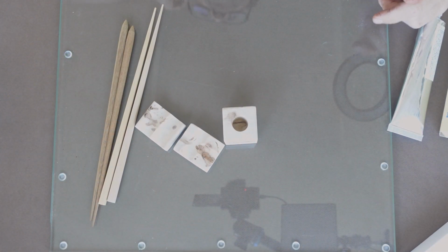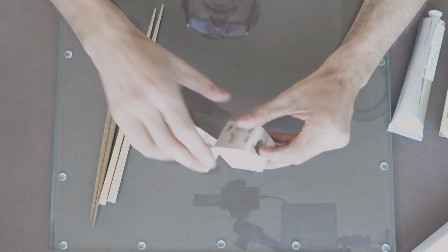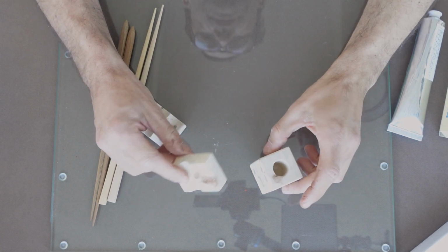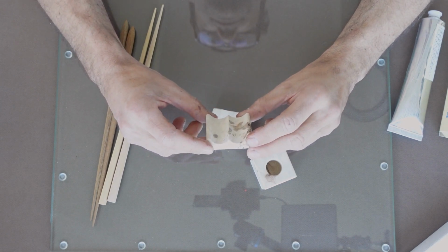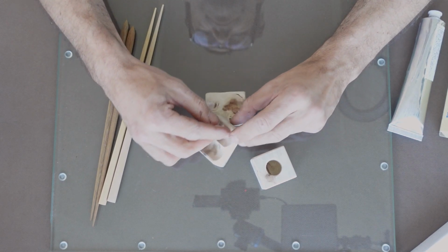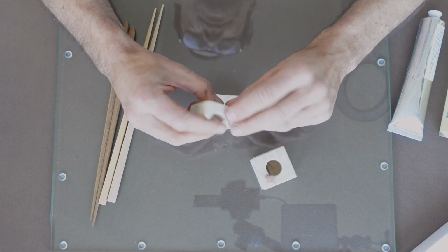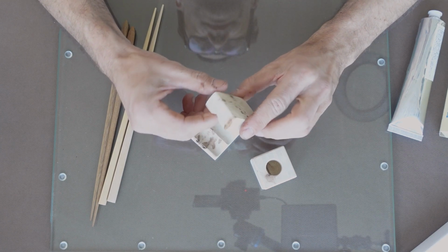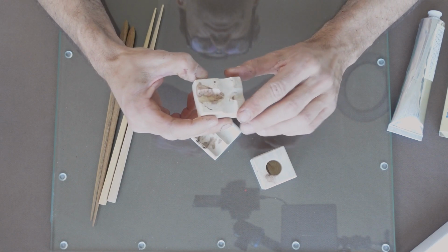So, fuki-urushi. What we need? We need wood or some wooden objects to lacquer, and in my case I made a few pen pillows, pen stands, pen pillows made of poplar burl, and this wood is very light and it has a lot of imperfections as burls do. So I do not expect a very even surface. It's very difficult to sand it smooth.